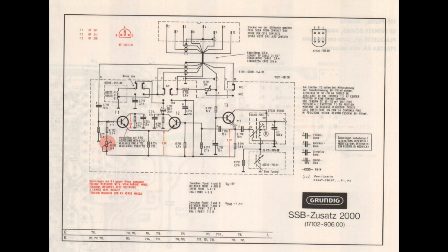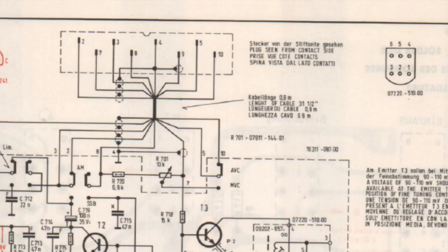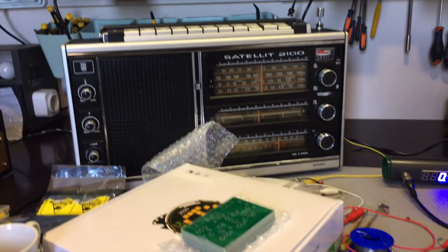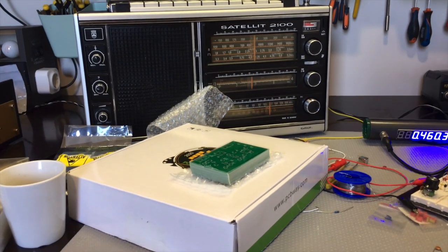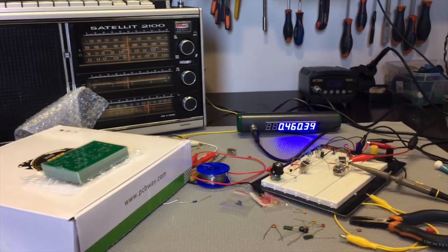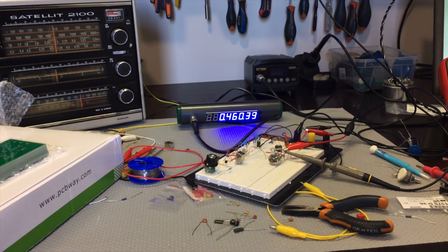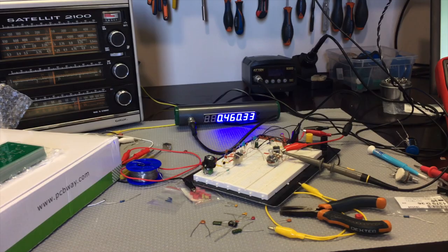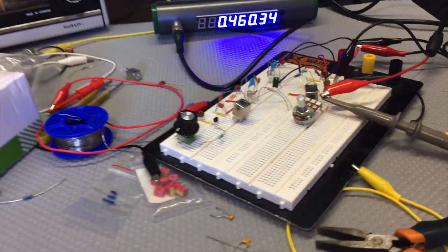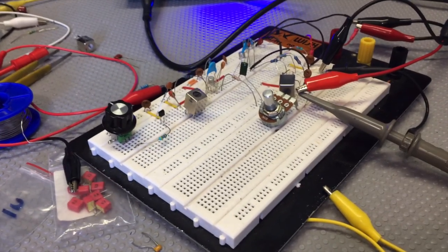That original unit is great because it takes out a whole lot of signals you need — one of them allows you to switch off the automatic gain control, and there's a manual gain control which helps. But there are quite a few coils on there that I find pretty difficult, if not impossible to get. So I decided I'd try to build one myself, and it's actually quite easy to start messing with it. This is what came of it — my experiment.